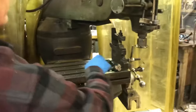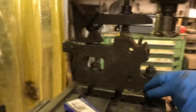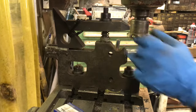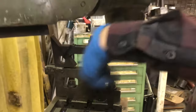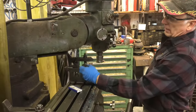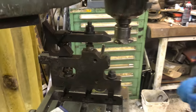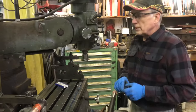This one actually dogs into the table in three places. It's steel — it doesn't move. About once a year as things wear, I line all three of them side by side, tilt the head, and make a new set of cuts in there. This will go anywhere from about one inch — I can cut any axle from one inch up to about two and a half inches before I run into that stud. I haven't had to cut any axles bigger than that, so this worked out well.